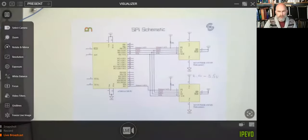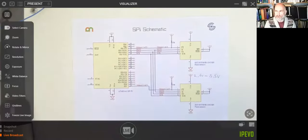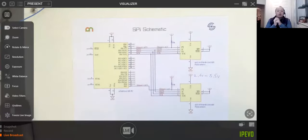And what sort of physical length of wire can these typically drive? Are you really looking at things on the same printed circuit board, or out to another cabinet? Funnily enough, we're going to talk about how to take these things off board in just a few moments. But yes, very good point, John. I2C and SPI are board level communications. They are designed for going from one side of a PCB to another side of a PCB. You could go over a short connector if you had a plug-in daughter board. They are not designed for going over long data cables. How you get them over long data cables, I've got that for you in 5 minutes. So stay tuned.